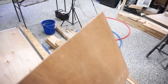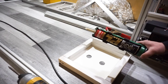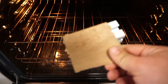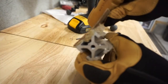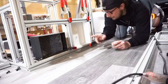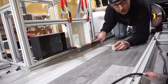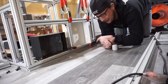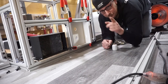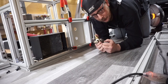We put the cap back on top and it can still sit on the lines but also have support at the front. So we took some two-by-two pieces of wood and eighth-inch thick plywood, built a box with a couple of holes in it, and painted it all white. Then we adhered it using our PL glue — which we've tested in the freezer and on the furnace and know holds up well — adhered it to the framing where we want it. I had to leave the clamps on for 24 hours, and we finished adhering this at 4 a.m. Sunday morning, meaning I had to wait until 4 a.m. Monday before removing the clamps — which explains why the video didn't come out Sunday.